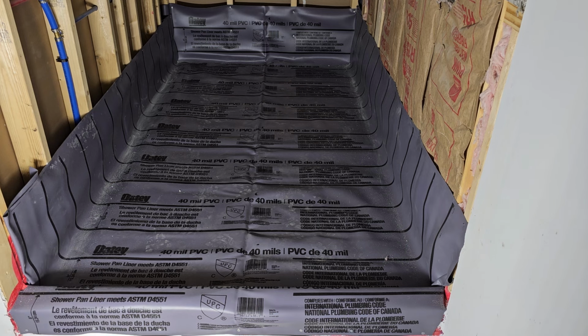So there's no reason that standing water is going to be above that point. So the rest of it, you still want watertight, but it's only watertight to the aspect of if water hits it and it runs off. Not watertight as far as needing to make sure that it can hold water, because it's never going to hold water. The curb is going to overflow before that happens.